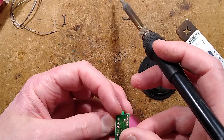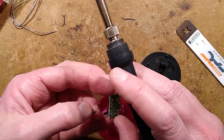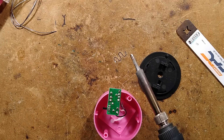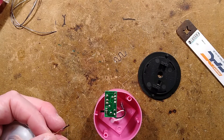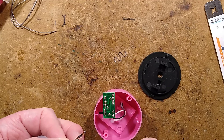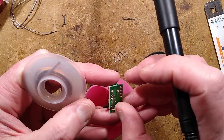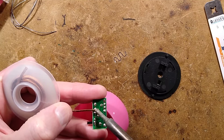Since this isn't just dropping out itself, I shall apply a bit of pressure on the other side while I heat both solder joints simultaneously. This is where I could have done with some desoldering braid - I do have desoldering braid here somewhere. The first one that comes to mind is tiny desoldering braid, but that'll do - that will work. It's better suited to tiny things but in this instance it will do amply well. I'll just end up using a bit more of it than expected. I shall grip it between my fingers and apply the soldering braid, and try not to melt my fingers with super duper heat.